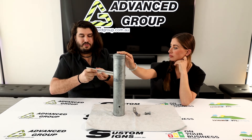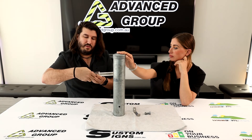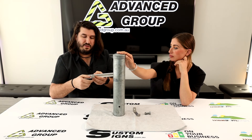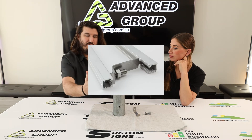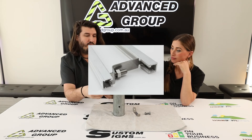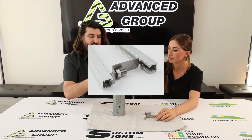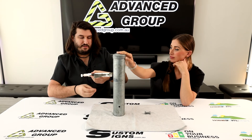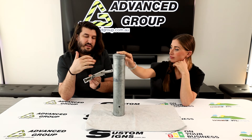That way you are able to put the thread of the bolt through the hole on the other side of this channel clip, and then do up the nut. The dimensions of this folded piece of steel are perfect so that, for whatever size post it's designed for, as you tighten the nut it's going to tighten the two signs against the pole so that they can't rotate on the pole or move up and down. On the other side you would have the cup head bolt with the nut that tensions it all up.